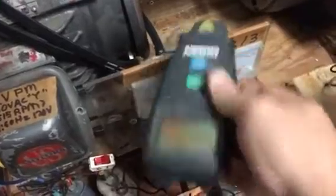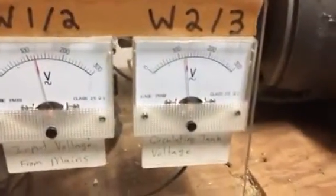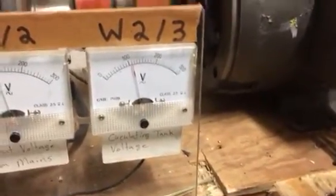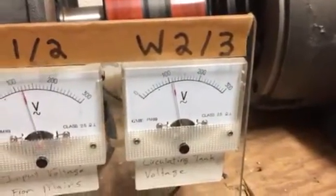I think I can switch out some more capacitance. As you can see it's a little over 120 volts right here, so I'm going to take that 5 µF out and drop it down. Now we've got it up here at about 120 volts.